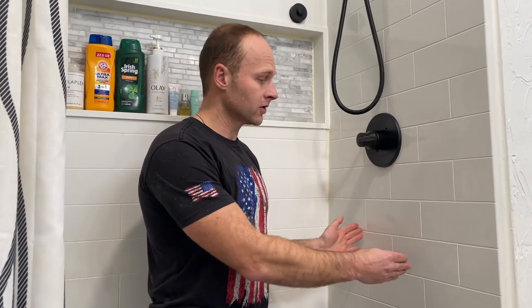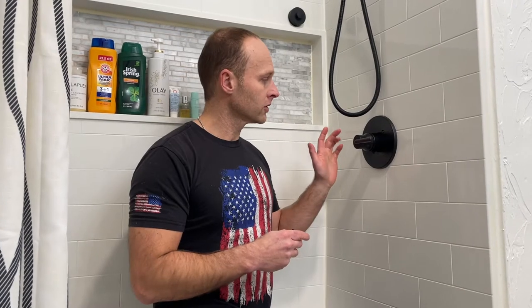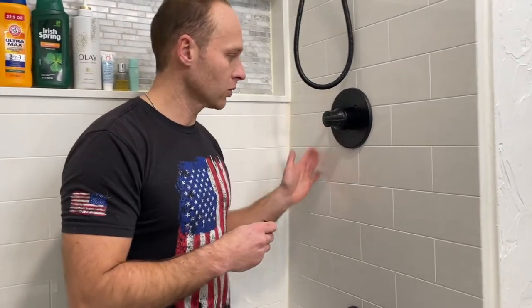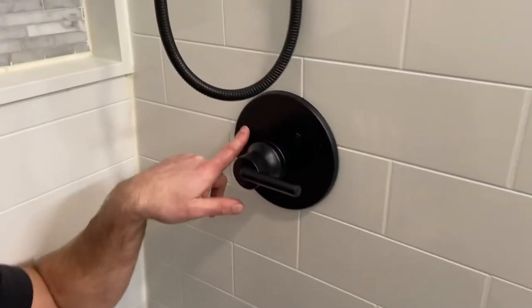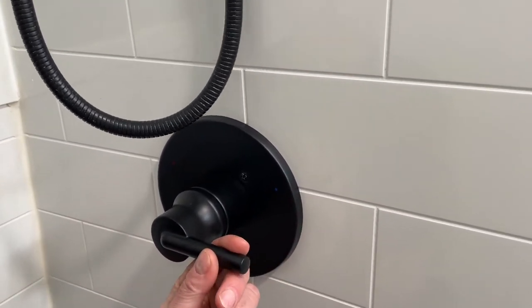Hey guys, Leg here, another quick video when it comes to shower faucets. I want to show you how to reverse your hot and cold water flow. The possibility is that you have some older pipes or somebody installed them incorrectly and your cold and hot is reversed, or the most likely fix is the cartridge inside your faucet is installed incorrectly. I'm going to be showing this on a Delta model, but it might work for others as well. Typically your hot water is on the left, your cold water is on the right — this is the standard way faucets should be installed. As you can see, it's marked here in red, so normally when we go left it should be hot.